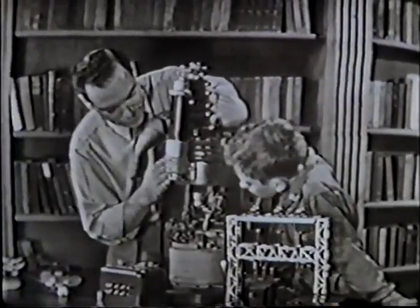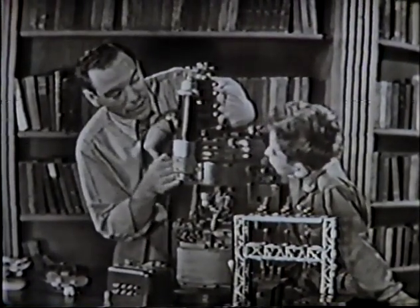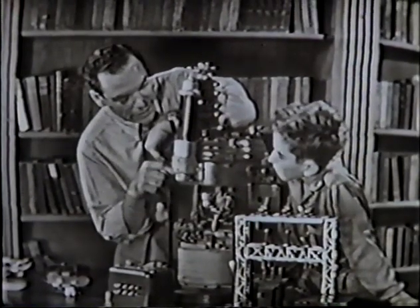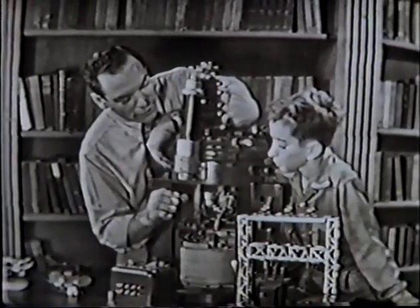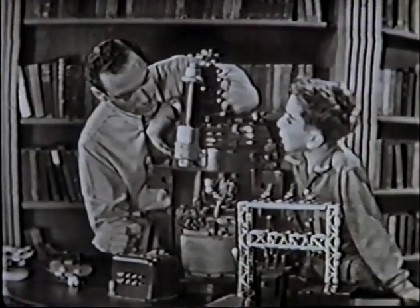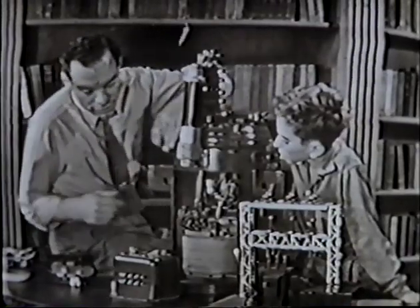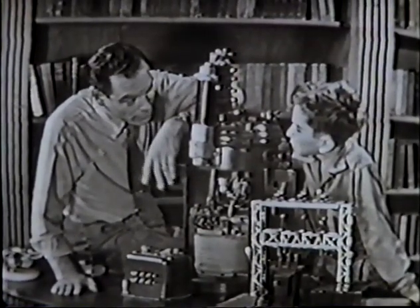So here's the thing that makes it possible for you to use voltage that was very high for toast and things like that. Now, we want to go from 120 down to six, for your train. So we have a step down again. So lots of coils in the primary and few coils in the secondary. How come you're always stepping down? Well, that's because we're trying to make the voltage less and less to make it less dangerous. But sometimes we want to go back up at home.